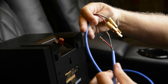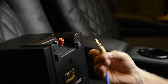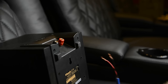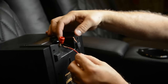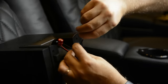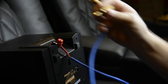First thing I want to do — I've got a short piece, probably about a two-foot speaker cable, and I'm going to be using this to plug into my wall plates that I've already got installed with speaker wire that runs through my walls. On one side I've got banana plugs. Banana plugs don't increase the value or the sound quality, but they do make it super convenient to connect. On the other end, we've got bare wire that I've already spliced. We're just going to give this a little twist, unscrew these terminal posts, feed that through the hole, and tighten it down nice and snug. Now if we did have banana plugs on this end, you can easily just slide them right into these posts, which makes it really convenient.